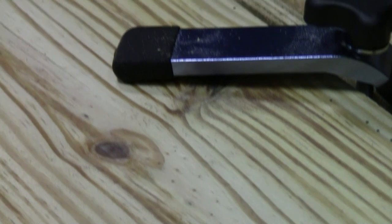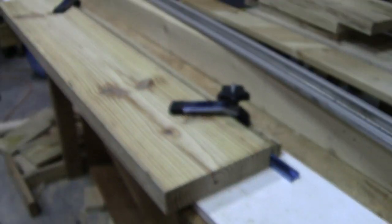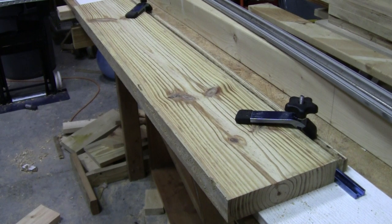This is about an inch and three-quarter thick, these pine boards that I'm doing. I've already planed them down and now I'm just trying to put fairly good edges on them. I'm not looking for perfection — I am going to join them together with dowels and everything. But if I can get them really close, I'm going to try my hand at electric planing with the hand planer just to take a little bit of the wander of the blade off of a table saw.